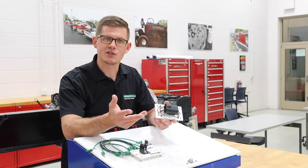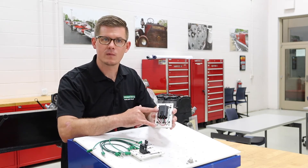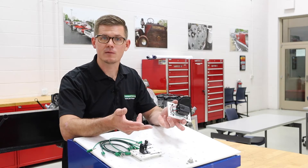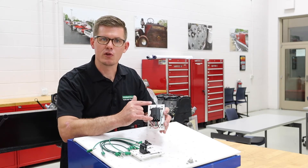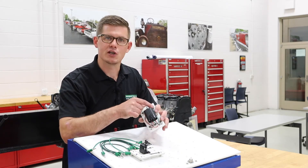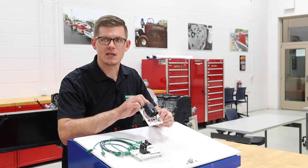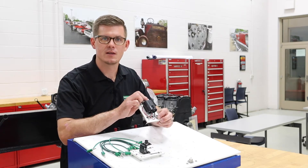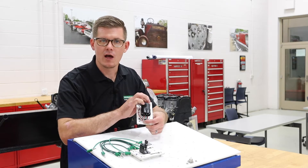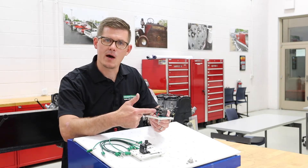Many relays have two points of flow on the action side — this one is one of those relays, so there are five total pins. Two go to my coil and help control the load. The other three are part of my action circuit and load circuit. Two of those points are set up as normally closed, often expressed on diagrams as NC. Normally closed means there is continuity or flow even with the relay off. When it gets energized, that point moves over to my other contact — that's my normally open position. Not all relays have those points; sometimes the normally open pin is present on the bottom but has been clipped off and wasn't manufactured to be utilized.